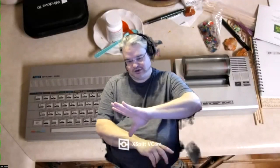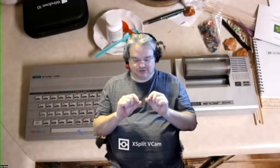It would be interesting to know, maybe if you've got a blog or something, the technical aspects of how you got the colors of the video, because it looks like you don't do anything internally, right? It's just a stock 2068 hardware wise. Your board just plugs in and takes whatever signals it needs. Well, actually, what I'm doing is snooping the bus, so that anytime the 2068 writes to the video RAM internally, I intercept all those signals and it writes to buffer RAM in the FPGA. Then the FPGA just sits in the background and converts that to a standard 640 by 480 compatible VGA signal. So I don't even worry about the signals coming out of the 2068. Okay, gotcha. Well, it'd be interesting to see if you could do something on a minimalistic standpoint, just for the video part.